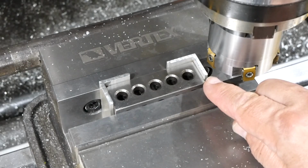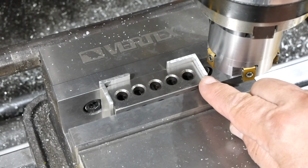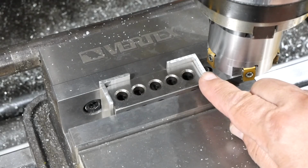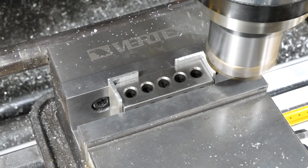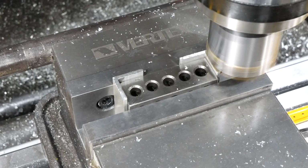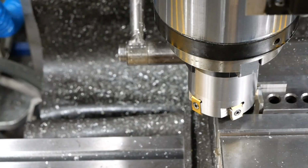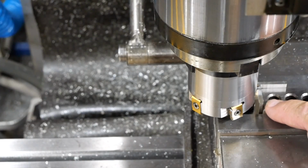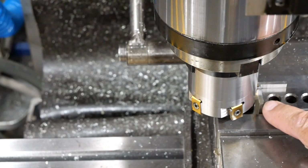So, getting started on the crankcase brackets. I've hacked off a couple of pieces of 25mm aluminium angle, and I've squared the other ends up, and so now I'm bringing these to length. So that's roughed them both to the same arbitrary length. Because I haven't decided yet what to do with the crankcase, which is nearly 0.5mm under length, I'm not going to take these to their final length at this point. I've just remembered that. So I'll take them to an arbitrary 55mm.